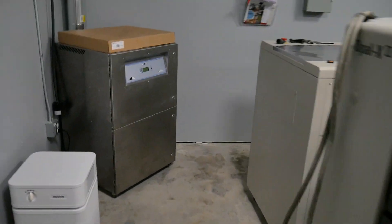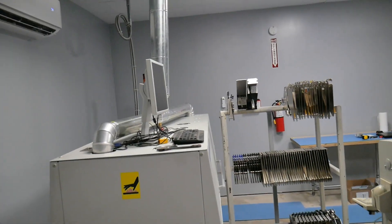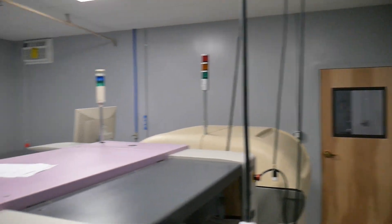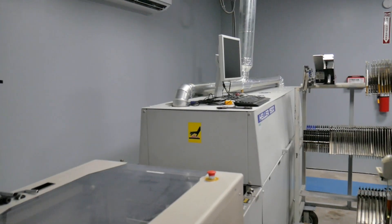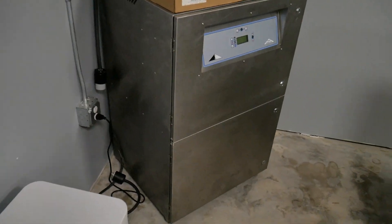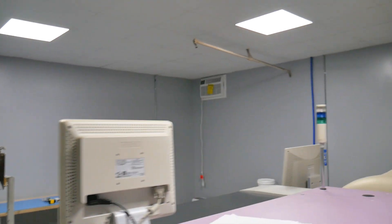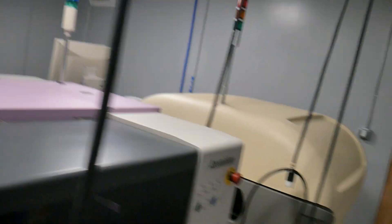One interesting thing with this assembly line, which is a bit different than most: typically the exhaust from the reflow oven gets ducted outside the building. But since this room is so small — only 600 square feet — if we had done that, it would create negative pressure and pull in tons of dirt, humidity, and heat from outside. So we have a filtration system that filters all the fumes and keeps it inside, which is why we need both the ductless AC and the wall unit we just installed — so a 600 square foot building has four tons of cooling power, which is pretty insane.